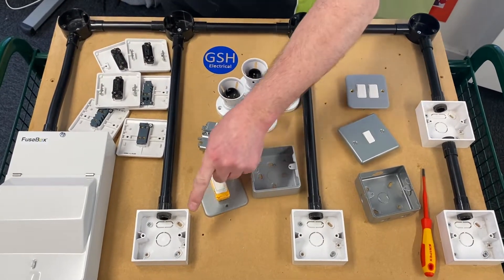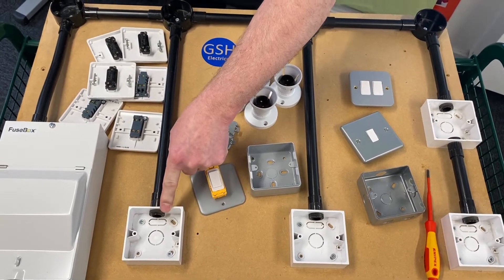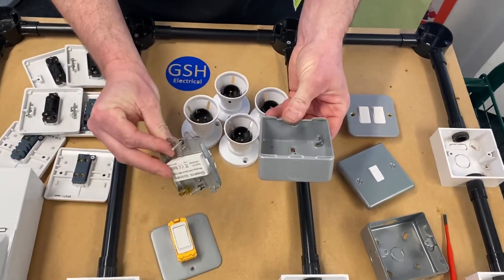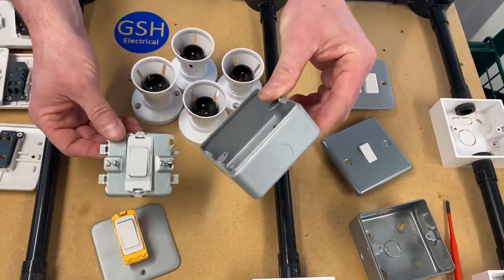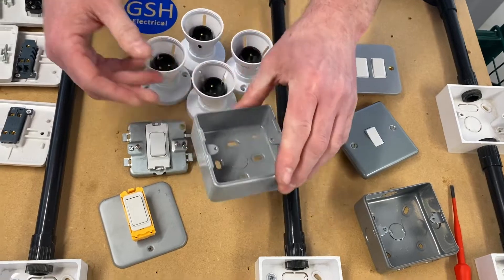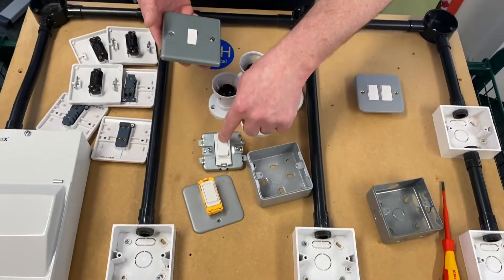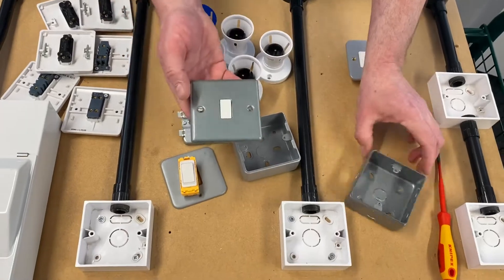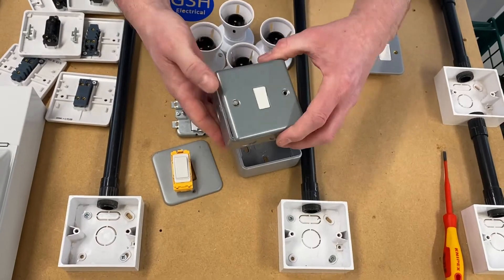The next question is why I'm using white molded plastic boxes, which I've drilled a hole in to put my conduit through, and not metal clad. In all the other videos on the channel where I'm using plastic conduit lighting circuits, and my students are building them as part of assessments, they're actually building them with black plastic conduit and metal clad with knockout boxes. We could have used fixed ones without a grid system — these are grid switches — or switches in a metal clad box, which are one-way, two-way, or intermediate.